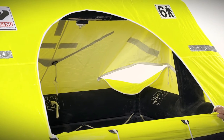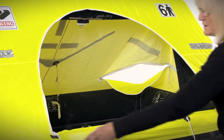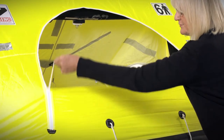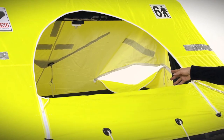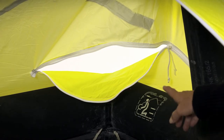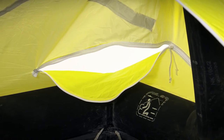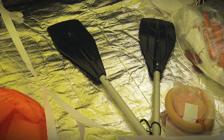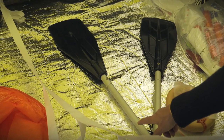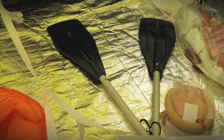The raft also has two easy zippers that zip from the bottom up, which will allow you to increase your freeboard if you're in heavy seas while still allowing air flow through the life raft. The raft has an additional opening in the back so that you're able to see 360 degrees around the life raft to see for rescuers, and it also provides cross ventilation. Your life raft will be equipped with either an aluminum foil floor or an inflatable double floor for protection from hypothermia.